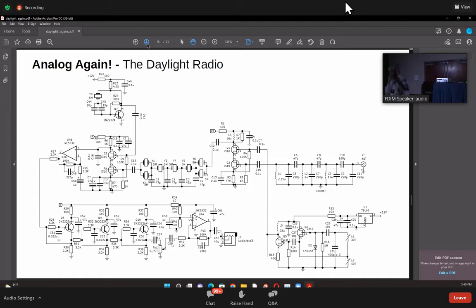Okay, this is the permeability tunable VFO. Essentially this part is 3D printed. There is one nut here and another nut sitting inside it, which hold a 1/4-20 bolt onto which you just wind this thing. It's really stable and it's linear. You get 25 kilohertz per turn. Of course, the tuning shaft keeps coming in and out, but that's actually a feature.